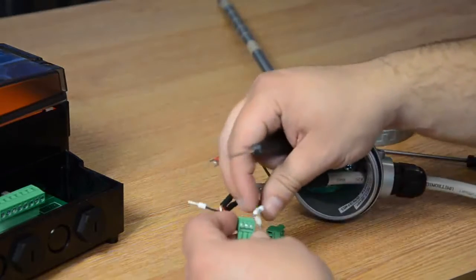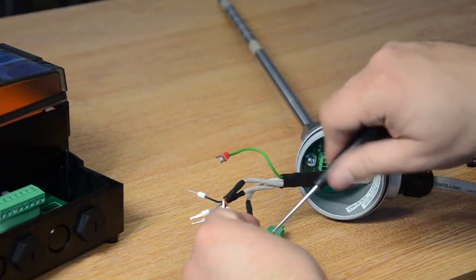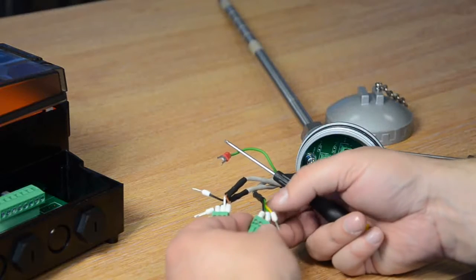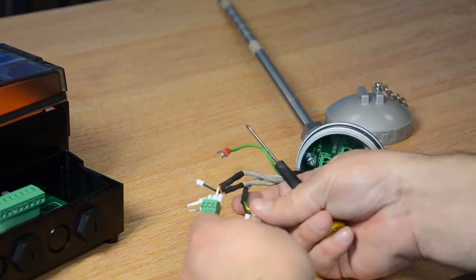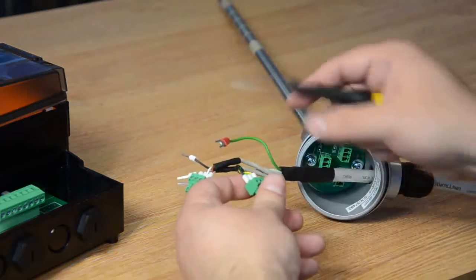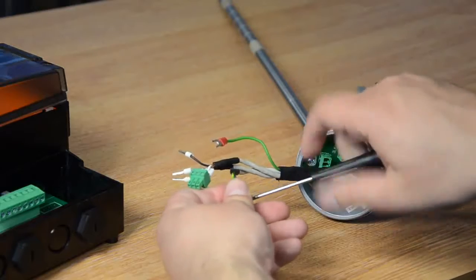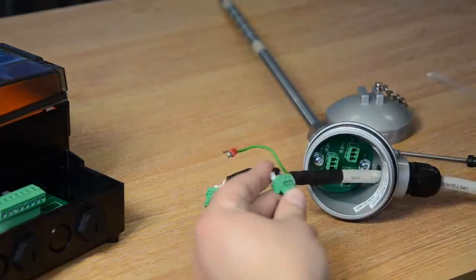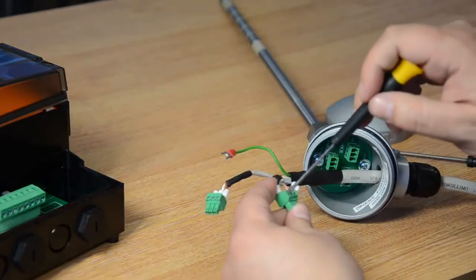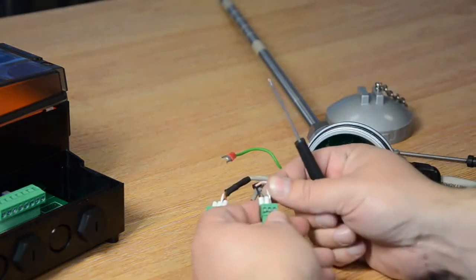For the second sensor, we will go to our green and yellow cable. Once more, black on the left. Your test, which is your green, goes into the middle. And your sense, which is our yellow cable, goes on the right hand side. Once more, all of these are from when you're looking at the screw side. So finally our third point, which you'll only have on 3-point probes, black on the left, grey, which is our test, in the middle, and pink, which is our sense, on the outside.